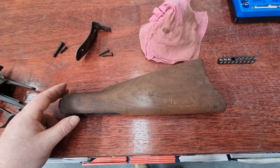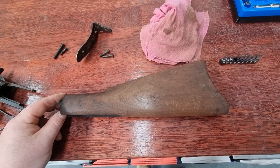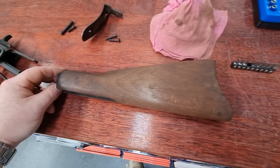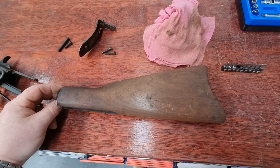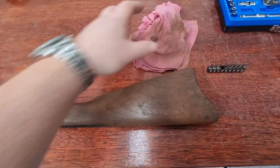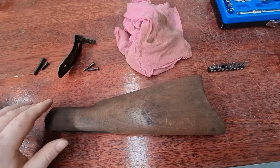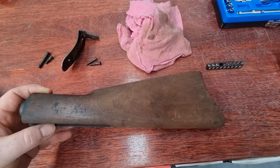It will take off all of your original finishes — it will take everything off down to just the regular bare wood. This is just maybe 30 seconds or a minute of just evenly, cleanly wiping the stock with the acetone-soaked rag. It really does take off everything.